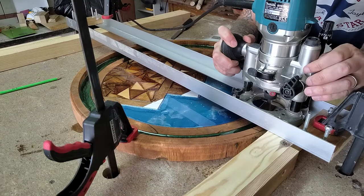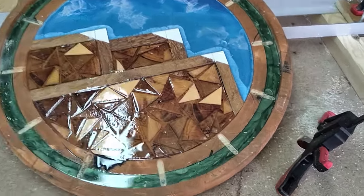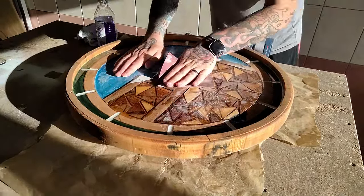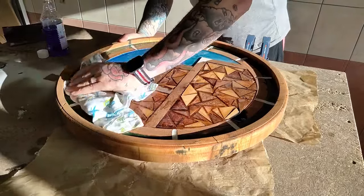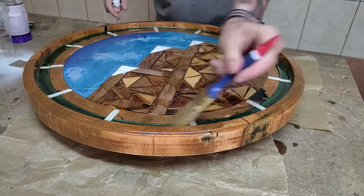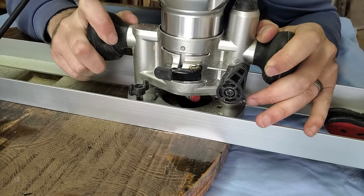Once we've a road map, it's time to start cutting the markers. Here they are — rough and unrefined carved slots for those markers. To bring them to life, I'm going to add some snow white epoxy. It seems like we're nearing the final stretch of this clock project, so it's time for the epoxy flood coats. First, I have to give the hardened epoxy a good sanding — the sanding roughens up the surface, giving the new epoxy something to grip onto. Next, I mix up a portion of clear epoxy and apply it with a brush. I give it some time to set and then apply a second coat. After a not-so-brief 48 hours waiting for it to completely cure, it's time to pay attention to the back of the timepiece — a couple of coats of bronze epoxy to seal up the rear. In amongst all this, I squeezed in time to cut a pair of keyhole slots to hang the clock.